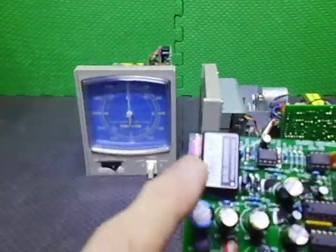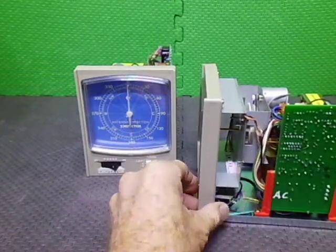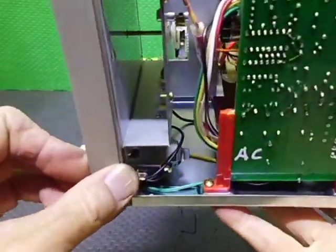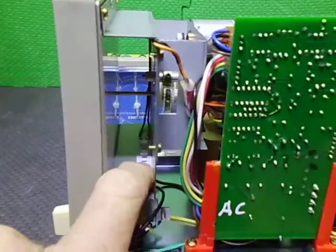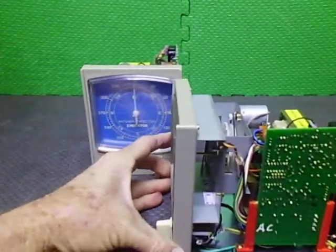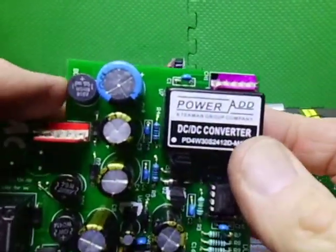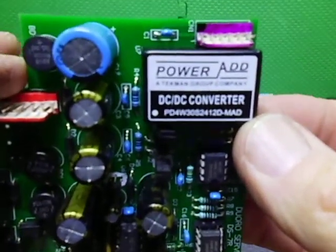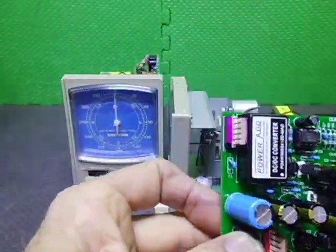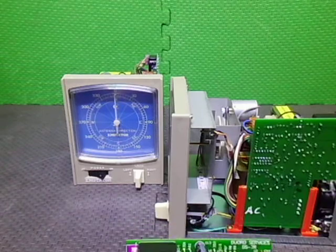I've put a buck booster on the side of the controllers here with a capacitor and a rectifier, and that gives me 12 volts. I've got an LED strip down in there and an LED strip in the top, so they run on 12 volts. It's a DC-DC converter — I get it from a local company and it will take any DC voltage from 8 to 35 volts and give you 12 volts out, very stable. The last thing you want is LEDs flickering or varying in brightness as you're driving things.